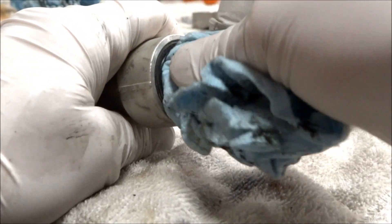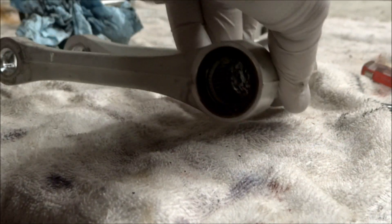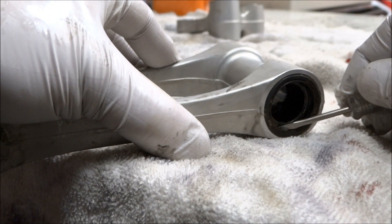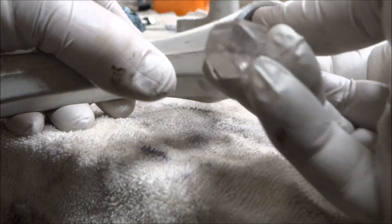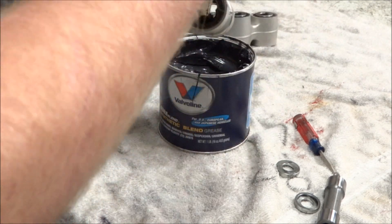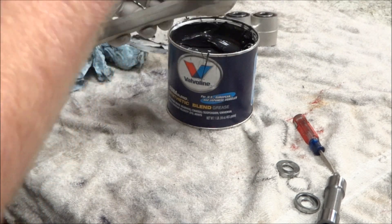After that, we're going to try to get as much of the old grease and dirt out of the bearing as possible. You've got to be careful with these bearings — they're not in a cage, so you don't want to knock them out or you'll have a mess trying to put them back together. It helps to just take a small screwdriver and get under that lip of the seal to get some of that old grease and dirt out. Then we're going to use that brush, dip it in the grease, and just start lightly putting some new grease on the bearings. You've got to be pretty careful not to upset the bearings in there.